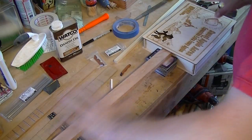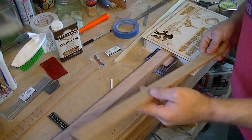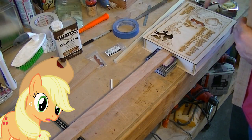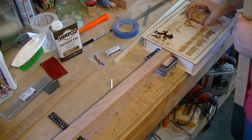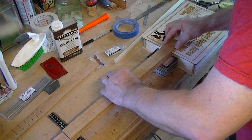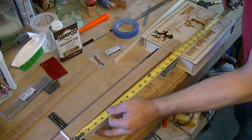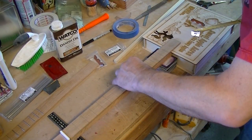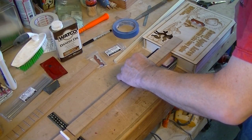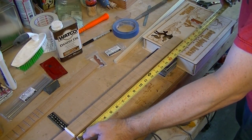We have our guitar pretty much laid out on the bench here. We need to determine how much of this fretboard we're keeping on our 25.5-inch scale, because I want the bridge to land about there — not covering any of the artwork. Let's put this on there, put our nut up there, get our measuring tool and figure out where we're at. That's 26, so we have to come back just a little bit. 25 and a quarter... 25 and a half. Perfect.